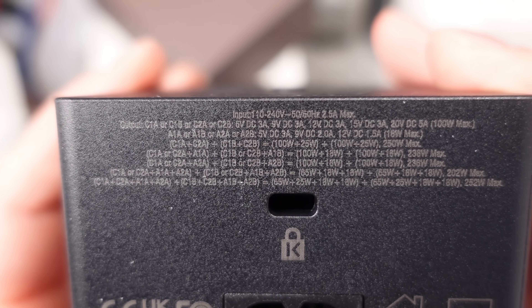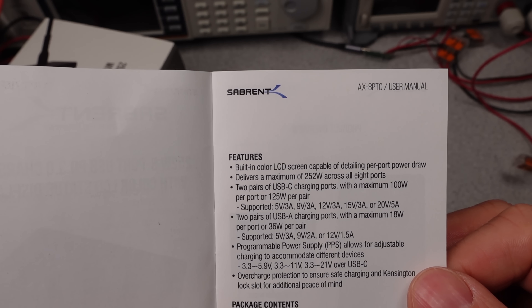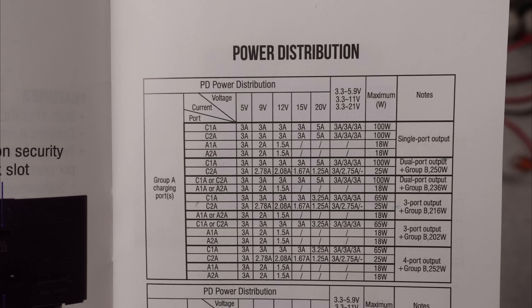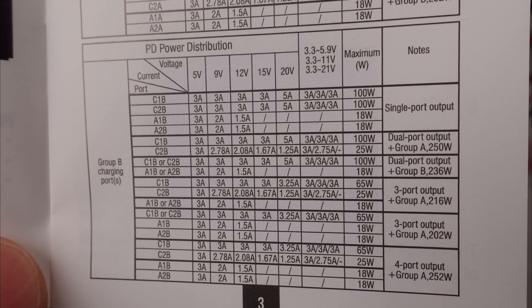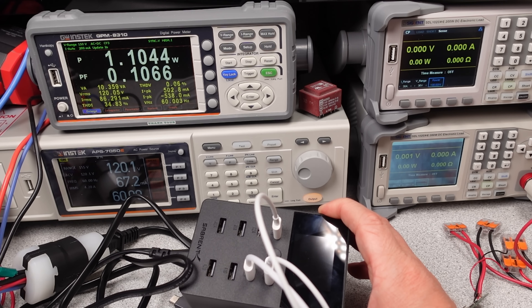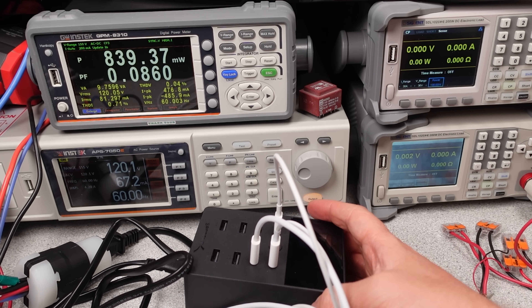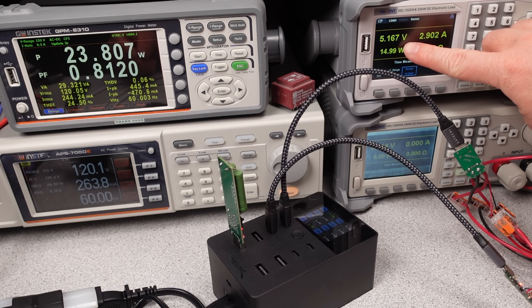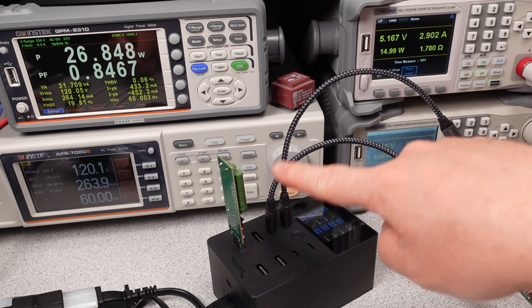Looking at the fairly comprehensive user manual, they talk about the power modes and distribution of power, and it gets really complicated. I just took pictures of the user manual — here is the first part of the table, and yeah, it's a bit confusing. This is the first four ports, bank A, and then with the other four ports, bank B. Pause to browse at your leisure. The main reason to get this device is because of the smarter power distribution. I did a bunch of tests with the USB-A port and the USB-C ports to see when the voltage resets and when the power stays on. It looks like the power stays on with the USB-C port only being used, but when you add in a USB-A port, the power level has to decrease so the port resets. If you aren't drawing more than 15 watts though, all the ports will stay on.